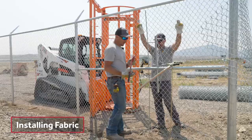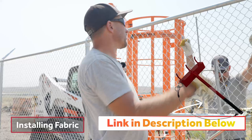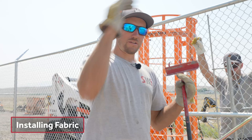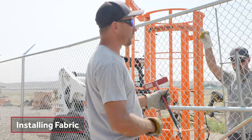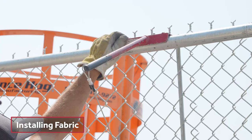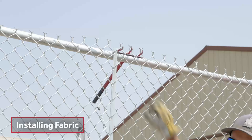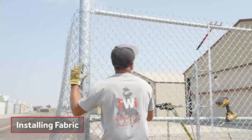This is a top rail dresser and it is designed to dress the top rail — to pull the top rail down whenever you're coming to a peak, to get that to flow really nice. Another thing we use it for is to hold the chain link up for us when we're doing a tie-off such as this. I'm going to hook it back to itself, back to the chain link. What we're looking for is half a diamond to be at the center of the top rail — that's where the chain link belongs.